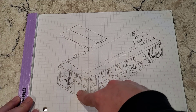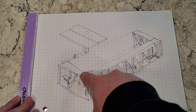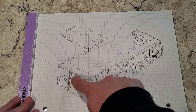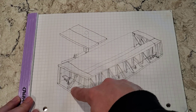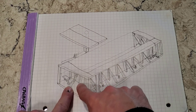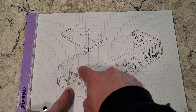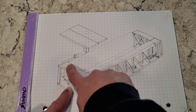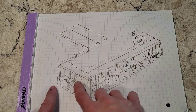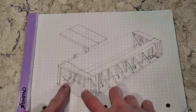I have a bunch of that 2x8 material. Having those 8-inch studs all the way across is going to help with resistance push in this direction, so I don't need any supports that way. The anchor on this corner is going to help with the push of this wall that way. And these walls aren't very long, so they don't really need anything crazy — but both sides will still be anchored in.